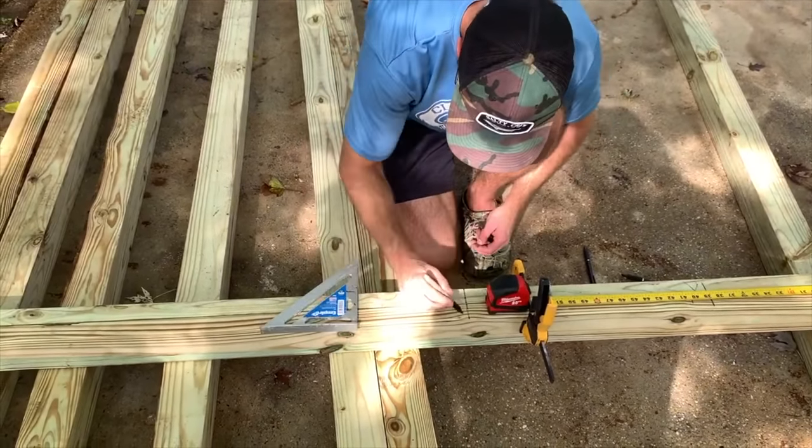After applying the sealant to the window's rough opening perimeter, you're going to take the window and prepare to permanently install it. Press the window's mounting flange up against the siding so that it's firmly embedded within the sealant. At this stage, you're going to want to try to locate that line on the side of the window and center the window within the window's rough opening. After centering the window left and right, use a level to make sure that your window is plumb and level across the top and bottom.